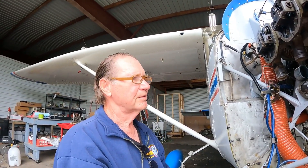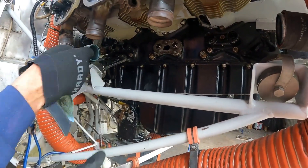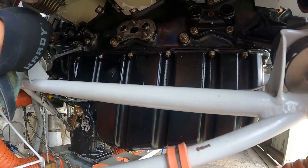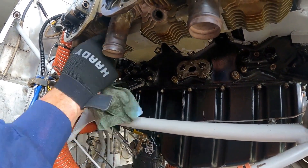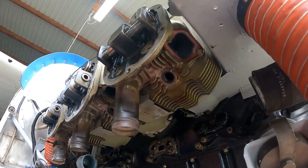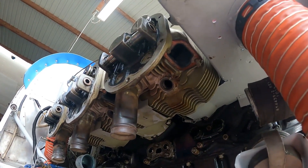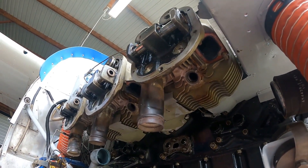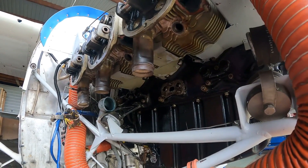This is a carbureted engine. The intake tube goes up through the carburetor through the pan, which is hot oil. The fuel goes into the intake tubes and then into each of the intake sides. It doesn't make obvious sense why it's designed that way — why would you want hot fuel, heated by your hot oil, going into your intake tubes? You'd really want cold, higher-density fuel — but aircraft engines do it differently than car engines.